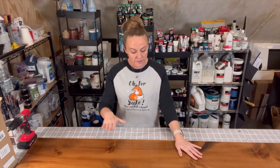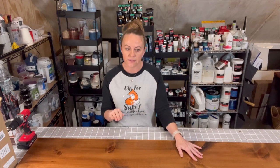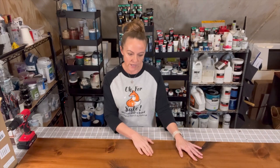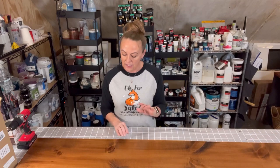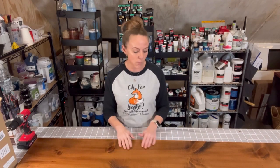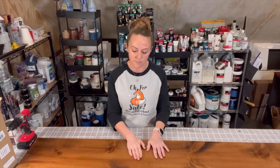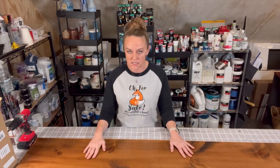This is going to be perfect. This is a pine board — it's the middle grade, what they call a quality board. They have a lower-end one where you'll get a lot bigger knots and more splitting, and it's just a very small price jump to go to this in-between board. Then there's another step up that will have almost no knots — beautiful, beautiful lumber — but it's almost triple the price of this in-between board. So again, for this type of project, this is perfect.